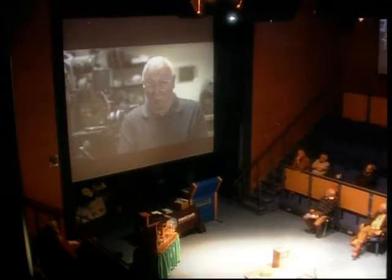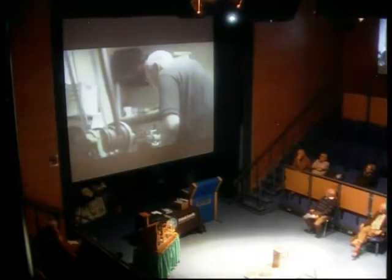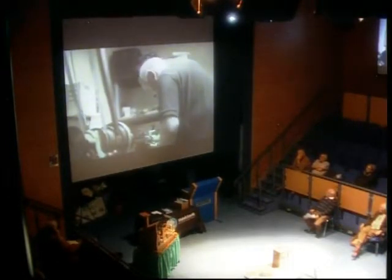The workshop that I've created to make these models is specifically done for the models themselves. The lathe that I use is 116 years old. It is ideally suited for making pins as small as 40 thousandths of an inch diameter, right up into the larger ones, which are 5 millimeters in diameter.